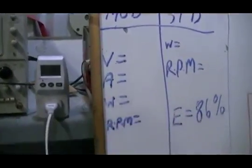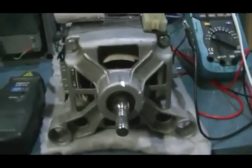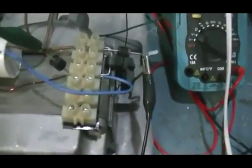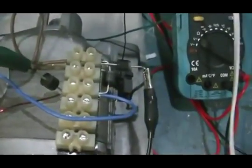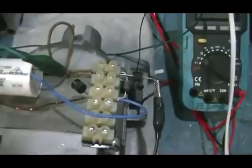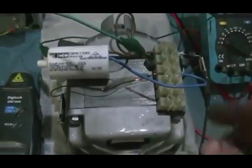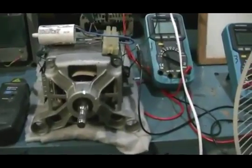We'll then switch the camera off, remove this fan, bash it back onto this shaft because it's a press fit, and we'll then go through and do the modified motor readings. What I've done here is I've just used an L-bridge, and we're returning the power from the coil back into the motor. I have a small 8uF cap on there just to capture some of the high voltage converted into current. So like I said, just a simple L-bridge — that way we can send the current from the coil back into the motor without the current from the transformer going into the coil.